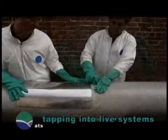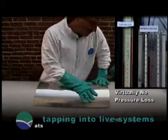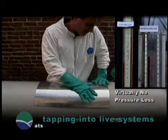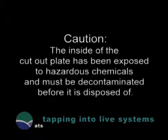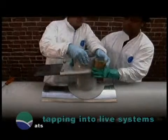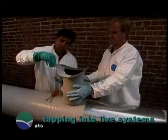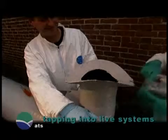When the cutting is complete, pull the plate out and away as you slide the sheet metal completely over the hole. Temporarily secure the cover plate to the duct area with clean room tape. The inside of the cutout plate has been exposed to hazardous chemicals and must be decontaminated before it is disposed of. Place 6 mil clear plastic over the tap and tape securely. Apply Kembon putty mix to the underside of the saddle flange, spreading the putty evenly creating a layer about 1/8 inch thick.